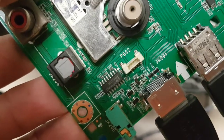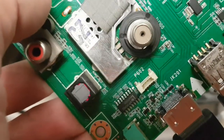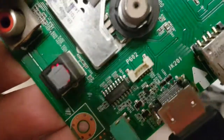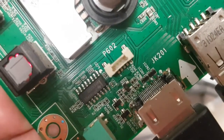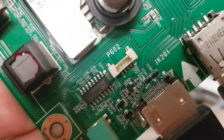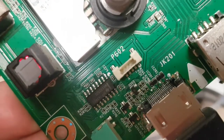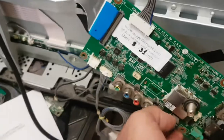I may be wrong — I will try after I make this video to search whether I have another video of that board before it was sent. I can see here where we did very careful micro-soldering when the original HDMI port was ripped off, and we had to do those small connections with really tiny wires going to the protectors and to the HDMI chip.